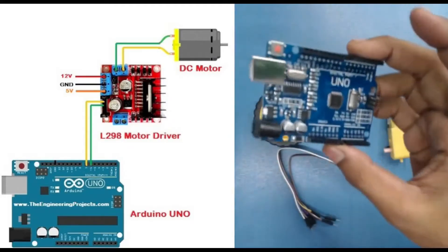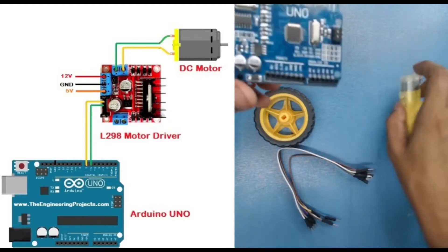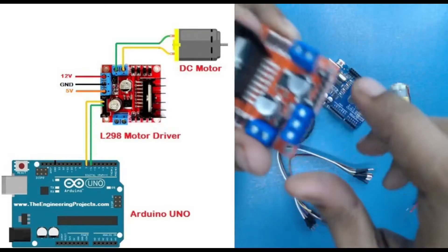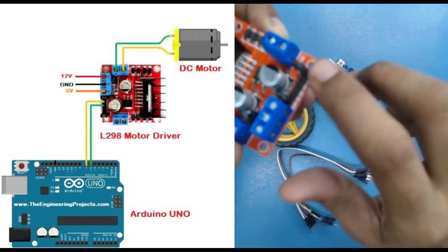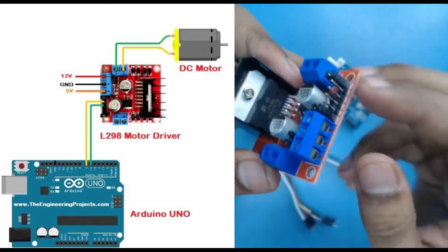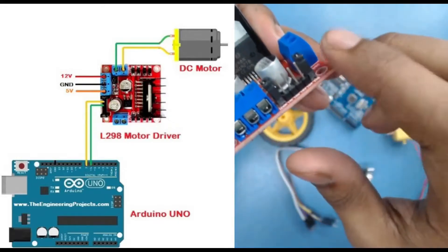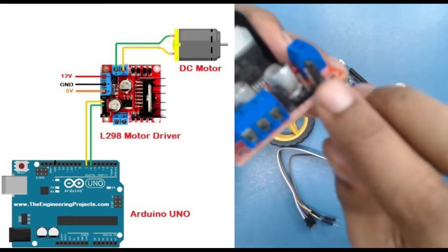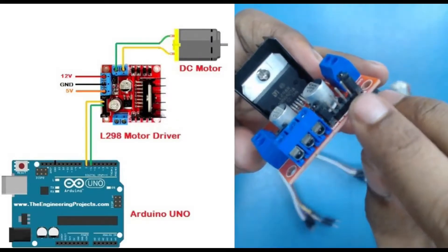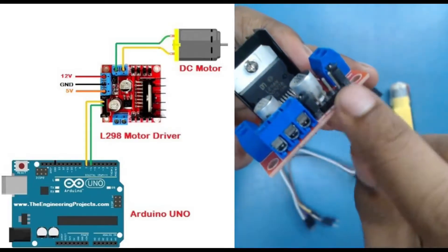For example, if we are using only a single motor, it will have two pins. If I connect on the right-hand side, for those four control pins I only need to use two — the third and fourth pins correspond to the right-hand side output. If I use the left section instead, I would use the first and second pins.